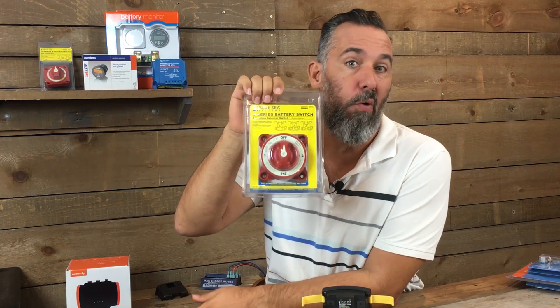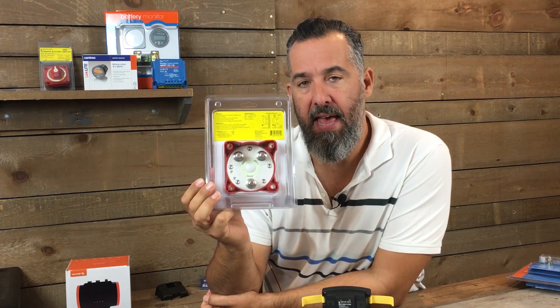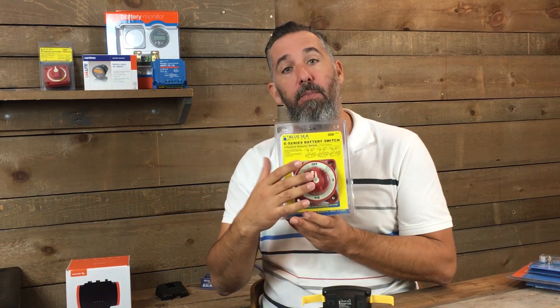The question is: where do you connect this? He's asking whether to connect directly to the battery or to the battery switch. This is a standard battery switch we have on our boats — an off/one/two/both switch. At the back you'll notice there are three posts: battery one, battery two, and a common. As a boater, if you're trying to avoid manually putting the battery switch on 'both' whenever there's a charging voltage — maybe you have a single-output inverter charger and want to share charging between battery one and the engine, or you have a single-output alternator and want to share between the engine battery and the house battery — right now you have to do that manually.